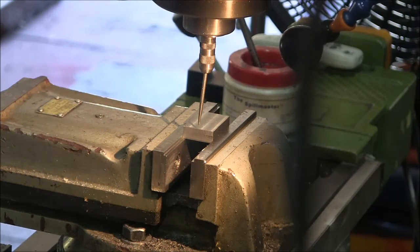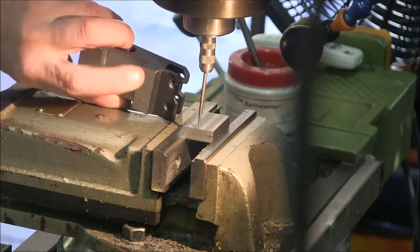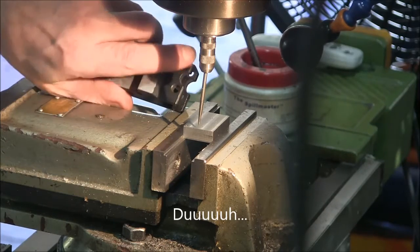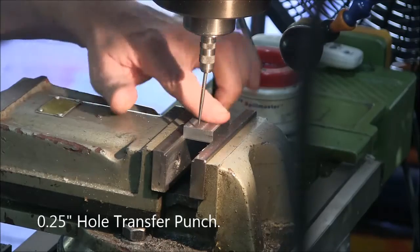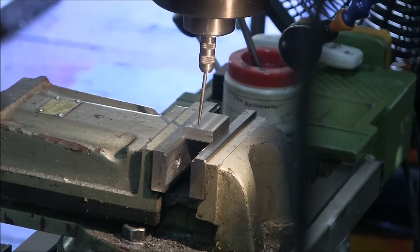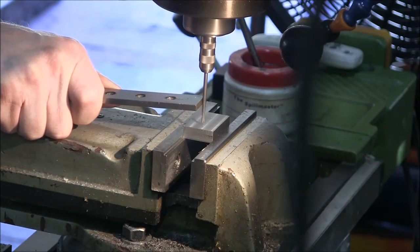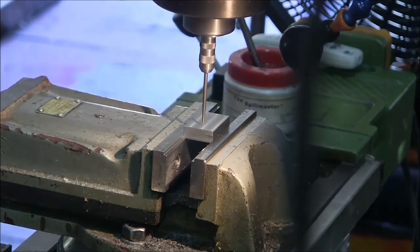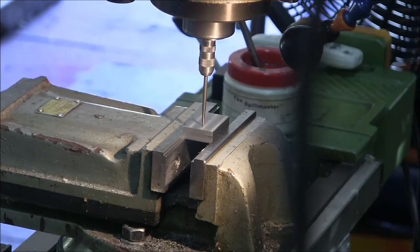Okay, so what I did off camera was to mount that block in between here and with center punch. What do they call those things? You know, the centering punches, the hole punches. I put center pop marks here in the block, and I used a wiggler to find it. So I'm assuming you've seen this all before, but let's just show it for the heck of it. That's how you find the approximate center there.